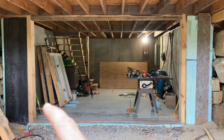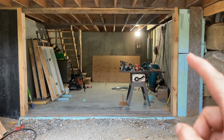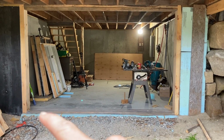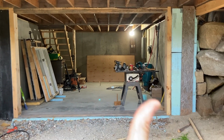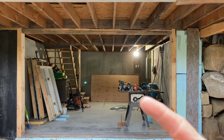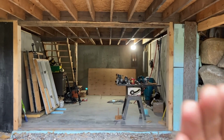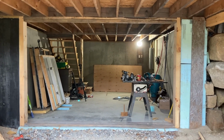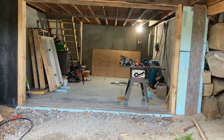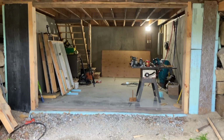So that had to be really heavy duty and anchored into the concrete. Same with that one there, because that's going to be holding up the hinges. You can see the sill plate on the bottom is pinning them that way and that way. And the top plates on the top are pinning it that way and that way. And the concrete anchor bolts are preventing any movement this way and that way. So that is locked in place. It's great.